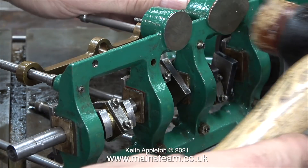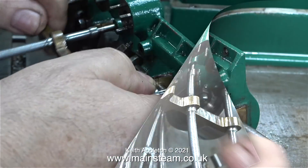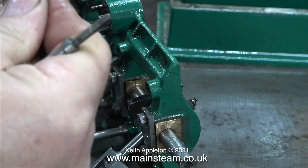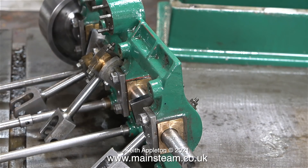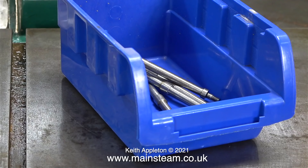Time now to loosen everything. This is not ultraviolence in any shape, way, or form — it's a soft hide hammer just to dislodge the parts. The hide end of the hammer is very forgiving; I've had steaks in restaurants that were about as tough as this. Sometimes it's good to hit things without doing any damage whatsoever. The columns on the other side were removed in exactly the same way, and here they all are in a plastic box.